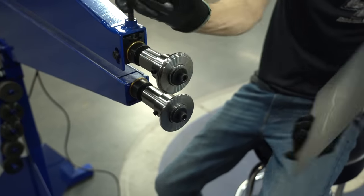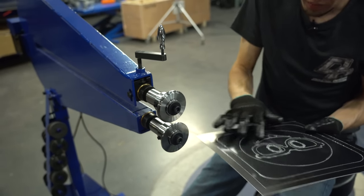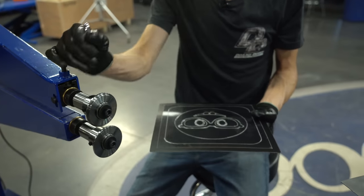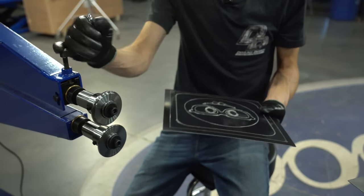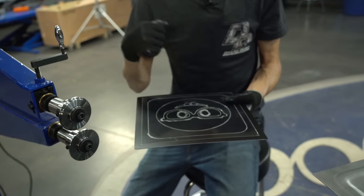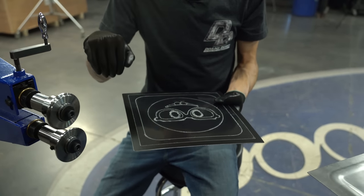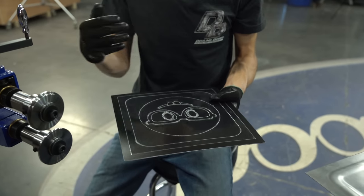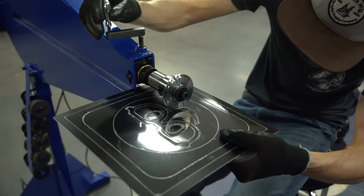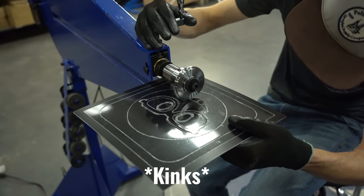I was kind of pulling it out as we got to that point — I'm trying to get that point so we don't have crossovers. That's really what helps: when you do that first pass and tighten the dies up without a ton of pressure, you can kind of get in there. Then the next time maybe fade it out a little before you get to the point, so it's not putting full pressure on at the point, and that'll help you not get those kinks.